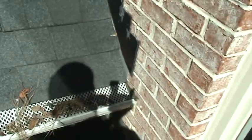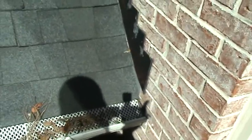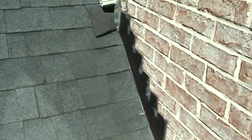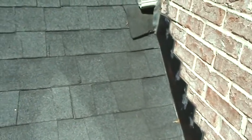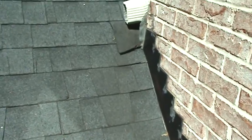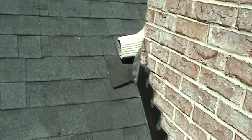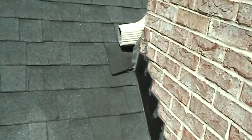A couple other things to point out here. Anywhere, if you've got a gutter guy, a roof guy, a carpentry guy, a Handy Andy, whoever it is trying to do something on your house, make sure your gutters are properly flashed where they hit the wall. If the builder didn't do it properly, you need to spend the money and do it properly, because it's safeguarding your house. So many people forget that the exterior of your home is the armor for your home. You forget about it because you're more interested in the kitchen or the great room or the master bath and all those living spaces that you use every day. But without this outside performing properly, it's going to cost you big money inside. It's going to hit your wallet hard. And that's what's happening to these folks here.